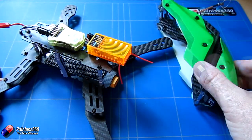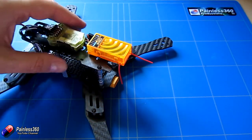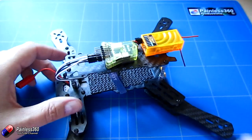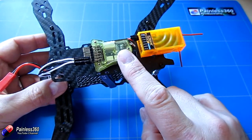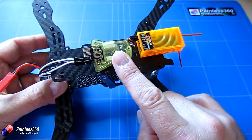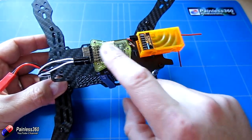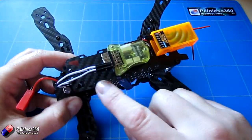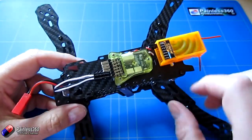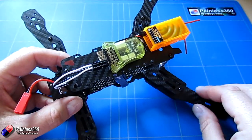Let me show you what I've done before we get the rest of the pieces out. I've just stuck a few components onto the chassis. The first thing you'll notice is I've gone for a CC3D Atom — very small, very lightweight. I don't want any GPS or other capabilities here. It'll run OpenPilot, which I'm going with for a very simple smooth flying quad. I've plugged in the cables from the power distribution board to keep it neat.